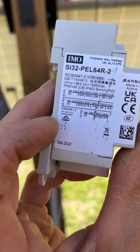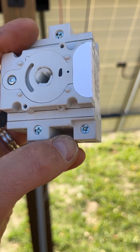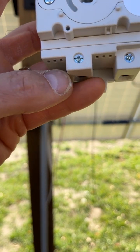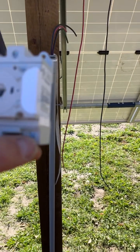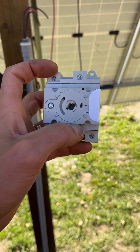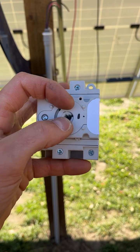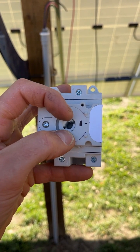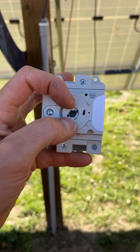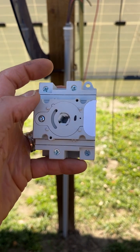On the diagram it shows one and two straight down, three and four straight down — but that's not how they're ordered physically. The numbering goes one, two on this side, then three and four on the other side. You cross over because with high-voltage DC you need a bigger distance between your contact points. AC light switches don't need that gap — if you put DC on a light switch it can jump the gap and burn your switch out and you'll be sending current without realizing it. So crossing over increases the gap between switch points and prevents accidental arcing.